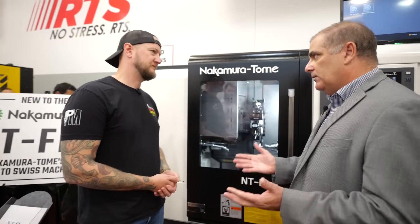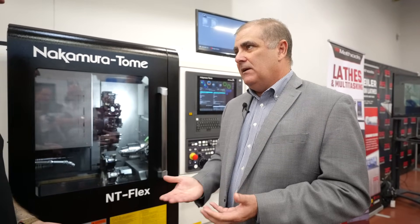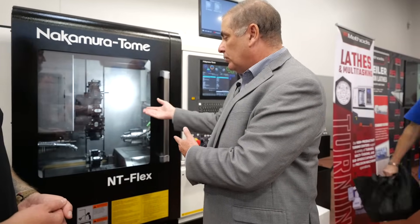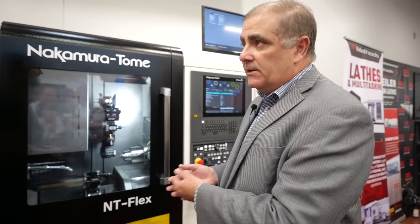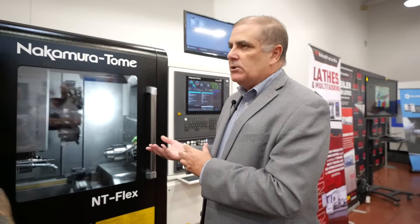Swiss machines have a fit — they've been around for a long time. They're a good fit for longer parts and high production. But changeover on Swiss machines can be a little difficult just because of the size of the machine — getting in, removing tool holders, putting new holders in. It's very compact and changeovers can be time consuming. On the NT Flex, the machine is pretty open. You open the door and have very good accessibility to the holders — removing and replacing a holder is much easier. The other advantage is rigidity. Anything over 25, 32, or 38 millimeter in a Swiss, the milling capability is somewhat limited — not as much horsepower, not as much rigidity. So if you have a part with a good amount of milling, this machine could be a faster solution over a Swiss, just because it's a lot more rigid.